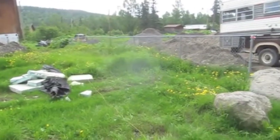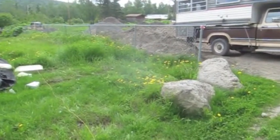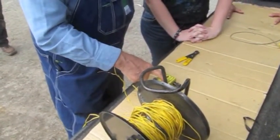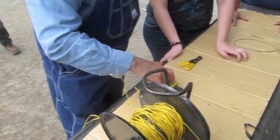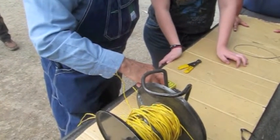What we do here is... this is a condenser discharge type blaster. It's got a 9-volt battery in it and a condenser. When you push the charge button and hold it down, it sucks the juice out of the 9-volt battery and runs it over in the condenser until it builds up to 225 volts DC.